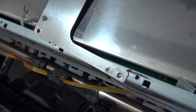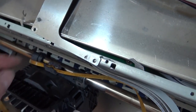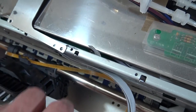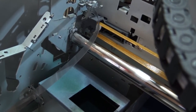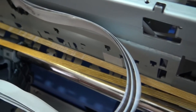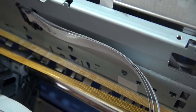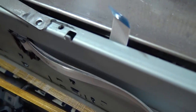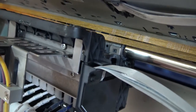So when you put the bottom of the belt on, when it goes into the carriage, it needs to be the bottom portion. As you see, as I bring this out, now it'll ride above it. Okay, I got that wheel back in, and I got it on the sprocket over here. So what I wanted you to see was when you place the dual-sided teeth into the carriage like this, when you go to close it, the belt needs to be above. See how that's still above?